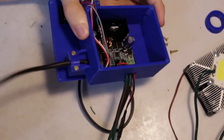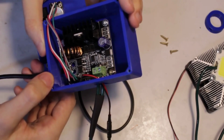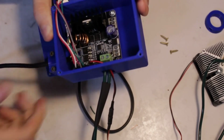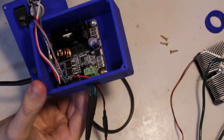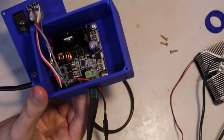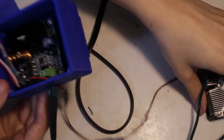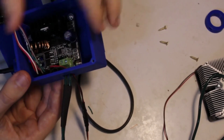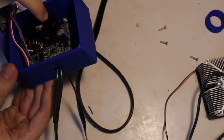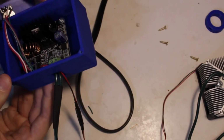And right here is the input from the power supply, and I did some strain relief right here because it's the only solder joint, so I really didn't want anything tugging on those, because if it rips up those contacts, it's ruined. Great board, actually. They had, linked down in the description, pins for the on-off switch, the potentiometer, a fan, and a nice beefy screw terminal for the LED contacts. Heatsink for that MOSFET? No. Maybe. I'll have to look that up.